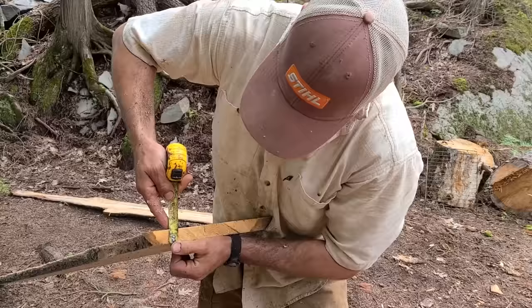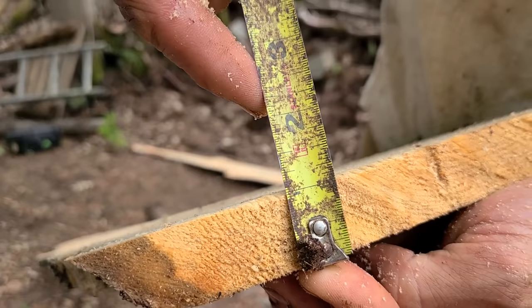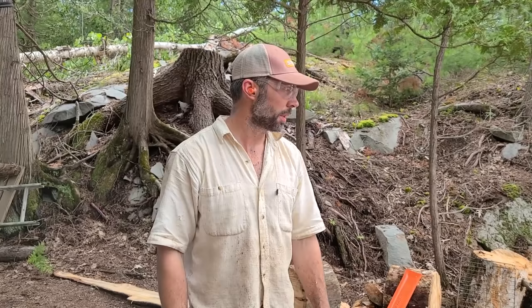First board. Yeah, first board. And yeah, I mean, it's like bang on 1 inch. And no thinking required. It's just like with the ratcheted lift there, every click is a quarter. The 3/8 pico chain that we have on there is exactly a quarter inch kerf. So basically just five clicks, quarter inch of sawdust, and 1 inch board. So that's pretty slick. Yeah, I like it.